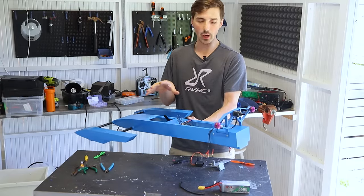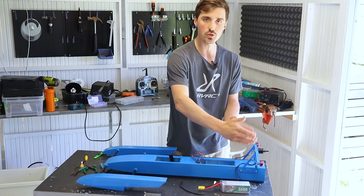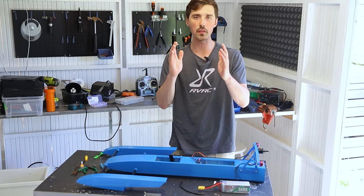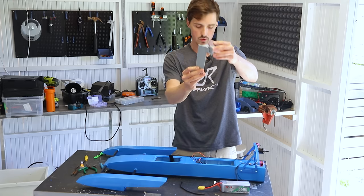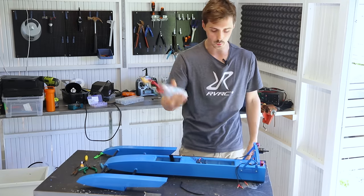Okay, here are some big changes coming up. The main reason is that the steering is non-existent. What I'm going to do to battle this is chop off the two side motors — they were off most of the time anyway, and at high speed they did absolutely nothing to make the boat go left or right. What I'm going to try instead is this 3D-printed rudder attached to a servo, which means we can use a battery half the size, half the weight — no problem.